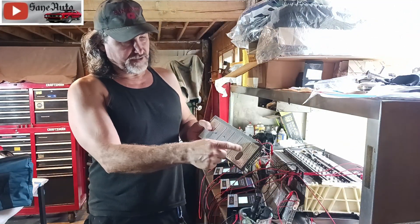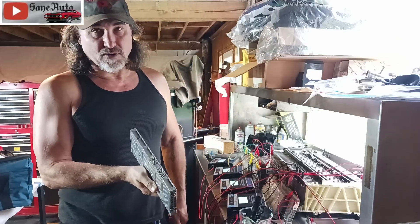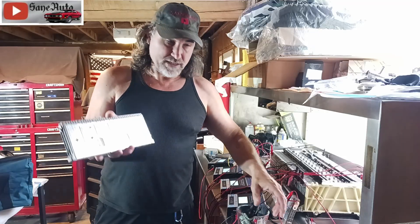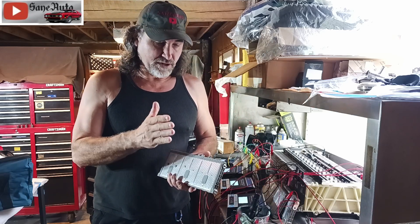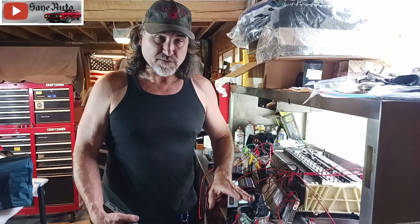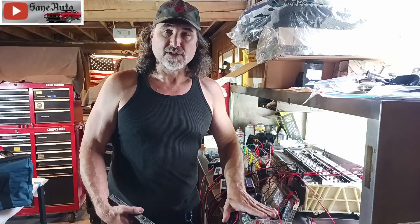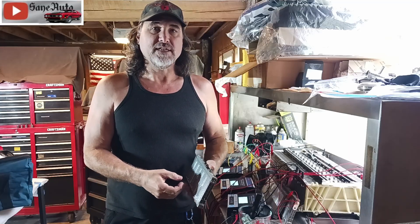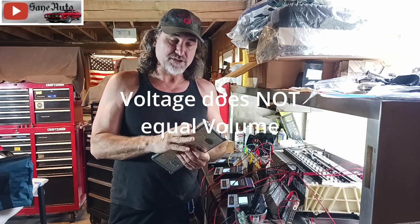What does that have to do with these modules? Well, these have cells in them — one, two, three, four, five, six cells — and each cell has plates in it. Those plates are getting really old, getting all gunked up, with cracks and spikes and everything else. A brand new one started out clean and now it's degraded. But it's not holding liquid — it's holding electricity. The pressure, like five to eight pounds per square inch, is like voltage, because voltage is a measurement of the force that electricity can exert — it's the pressure that electricity is under. It has nothing to do with volume.